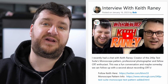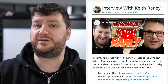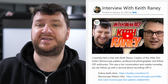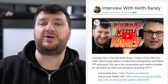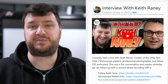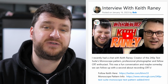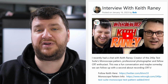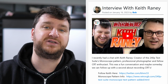I recently posted an interview with Keith Rainey, who designed the Monoscope pattern that's now in the 240p test suite, which is a really important tool to use because not only does it help overall geometry calibration of your RGB monitors, but it also helps just basic aspect ratio setting, which is something that's especially cool if you want to set up like a 16:9 CRT, or if you just want to make sure to tweak your 4:3 CRTs so that the geometry, even the basic horizontal and vertical centering, can be as good as possible.